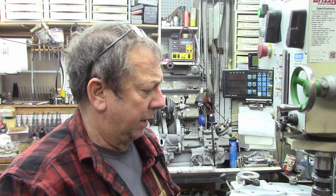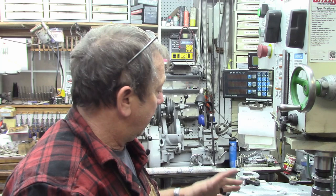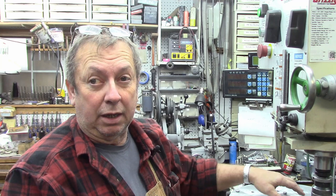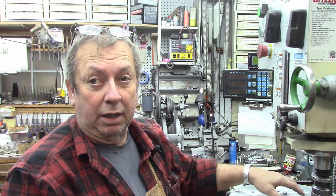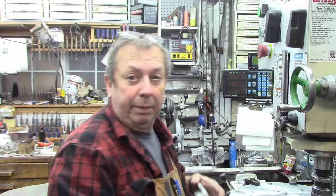Starting the day off with a little housekeeping. I still have the gearbox bolted down to the mill table and actually need the mill. I was going to finish this up yesterday but didn't get that far. I've already drilled and tapped the gearbox itself on most of the top-hand-side holes. Once I get the bottom drilled and tapped, the next thing I have to do is turn the two shafts that go through this gearbox - both one inch shafts.